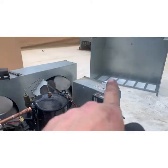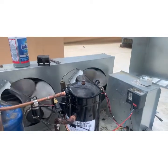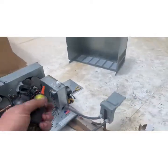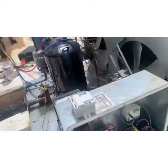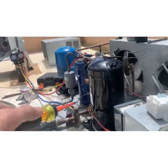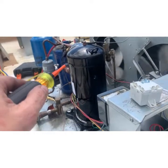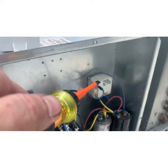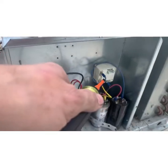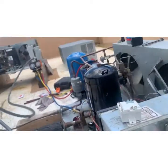It also smoked the potential relay. It ran and pulled down, started and stopped a few times — and then the fans were running but not the compressor. I tested the relay and it was bad. There's a United Refrigeration right down the way. I called my guy, and kind of shame on them — but shame on me — this is an exact replacement compressor, but it didn't come with the start components. This relay is what's meant for that compressor; the one that came with it was meant for the other one. Even though they're the same compressor, they've switched to that relay. I had them check the capacitor too — that's the same, it's a 40, so I don't have to change that.